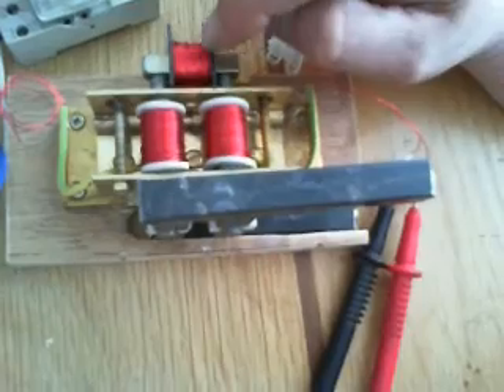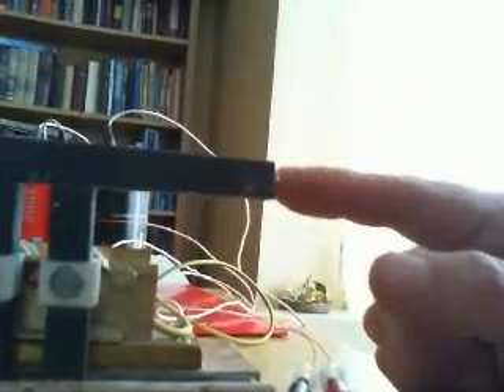So I built a little implementation of that, and here it is. Instead of having a straightforward single piece of iron, what I've done is bend it around a U-shape. Here you can see my drive coil, and there's the iron connecting it to these two output coils, which are led through into this framework here. What I've done is put two one-centimetre neodymium magnets, one pointing north and one pointing south — essentially the same effect. The coils are wound in a one-to-one ratio, so we don't actually get any coil transformation; any step-up that occurs is occurring just because of the action of the magnets included in the framework.